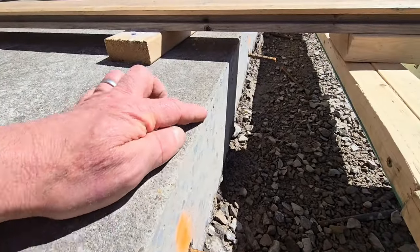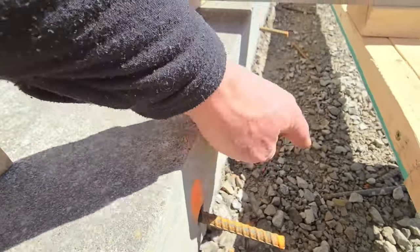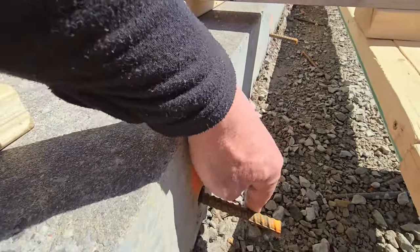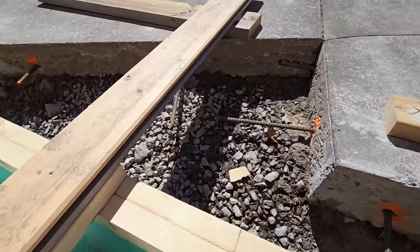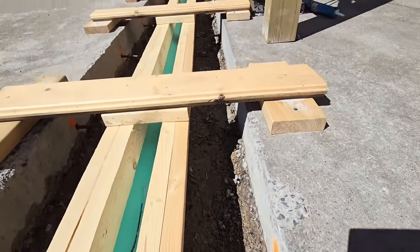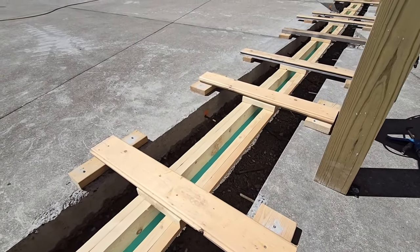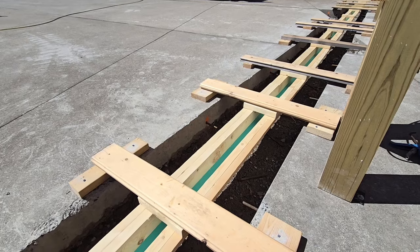He was just saying how if you don't do this, your other concrete right here needs these rods to hold it. You got heating up and cooling down and water and freezing and thawing. These won't stay level if they're not rodded like this. You have a piece of concrete that heaves up or sinks down. I didn't say anything about that when I was filming earlier. How far apart are these, Brian? Every 2 foot. So there's a rod every 2 foot. Once you get it cut open and get your concrete pulled out, you just hammer drill in there and stick them rods in there.